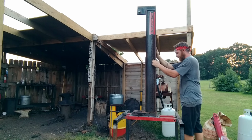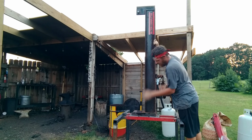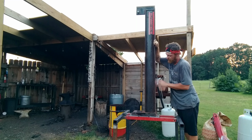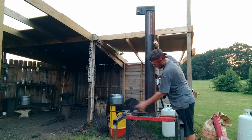So that is my next step, is to weld this stand, the plate that's on here, to the beam. So we're going to come in here and we're going to put a bunch of weld all the way around this. And then that plate is bolted onto here. That way if I ever have to remove this thing and take it off, I ain't got to cut welds and that crap. Just take these bolts out. They're through bolted all the way through. So get this cleaned up and weld the stand up on there, or weld the beam on there.